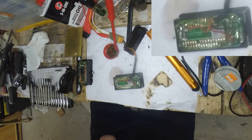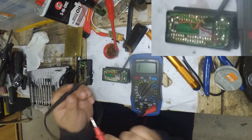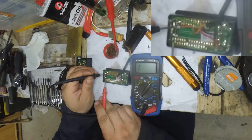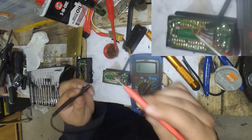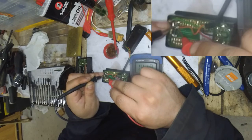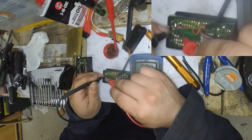So let's find out what the multimeter says now. Does the diode work in both directions? We have one direction working, and the other direction — no connection at all — so that's good. Now let's just confirm that this blob of solder is not connected to anything else nearby. Lovely — awesome. Let's just confirm that one as well. Within itself it's connecting.